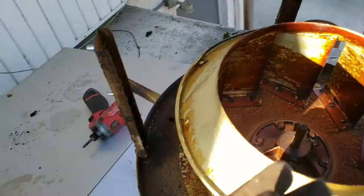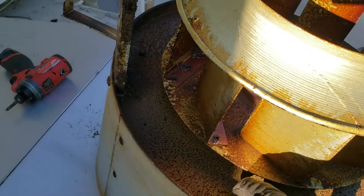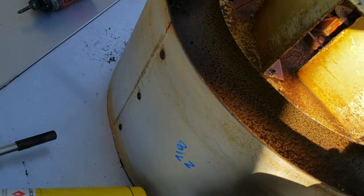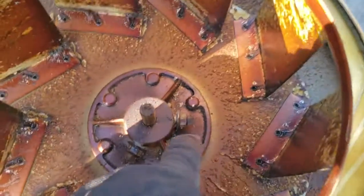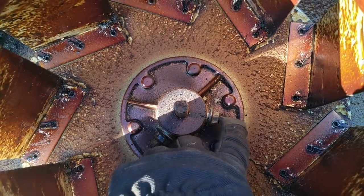Getting back to how I decided where it goes — I measured from here to there and wrote it down. Two inches and seven eighths is the gap between here and there, so it should be identical on the replacement. You have a locking nut here which you want to loosen first.